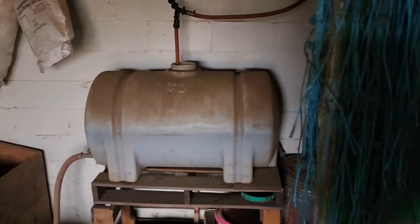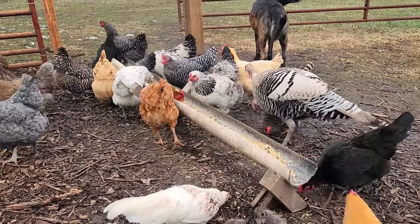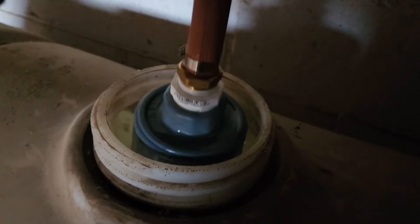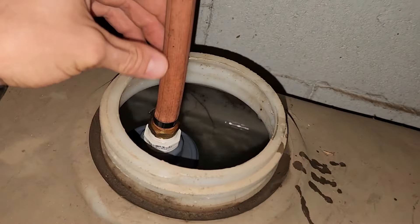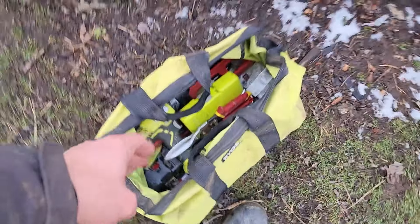My main goal today is to get these front two pasture gates hung, but I also have a gate in the back I might want to get hung if I have enough time. I need to go around back and hook up the water again — I unhooked the hoses last night so they didn't freeze. We got just over 100 gallons from the snow melt and rain this weekend. I still don't have this float valve working — I can't figure it out. I've had it hanging straight, I've had it deeper in the water, I reduced the valve pressure, flipped the gaskets every direction — it still won't stop overflowing. I might go to tractor supply and look at a new one in the box to see if mine's missing a gasket or a piece.